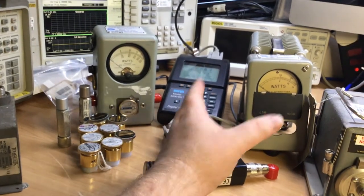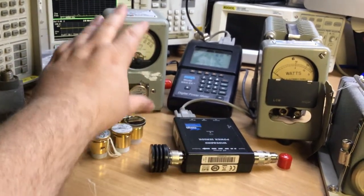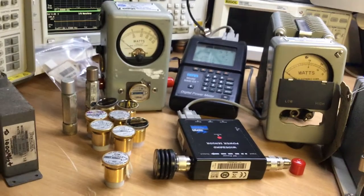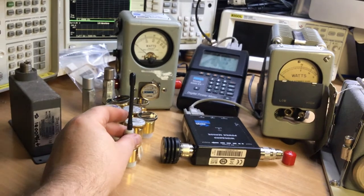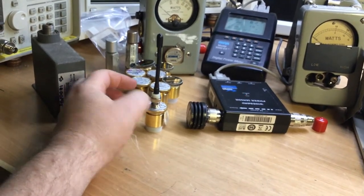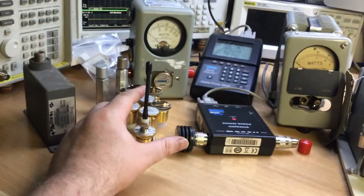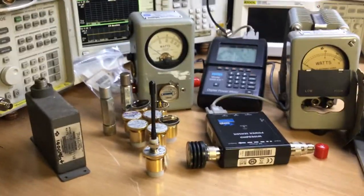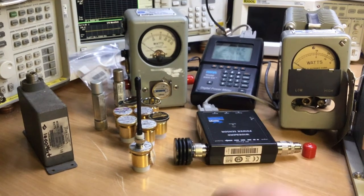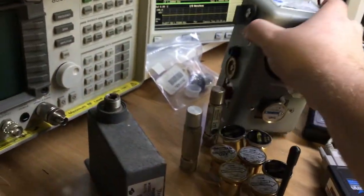The Bird 5000 EX was designed for both analog and digital modes. There was also a useful accessory — a pod with a helical aerial on it that had a BNC connector and took a battery inside. Basically it was a field strength meter insert that plugged into the Bird 43 and gave it the capability of measuring field strength with a near-field measurement within close proximity to a transmitter source or antenna.